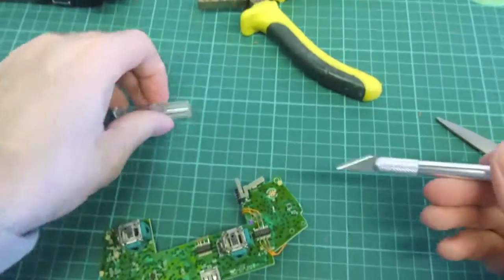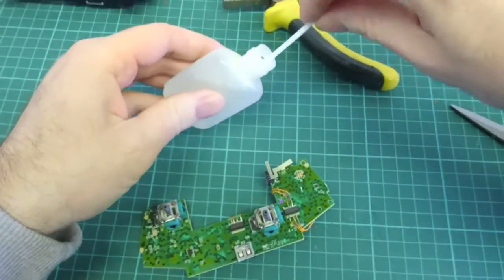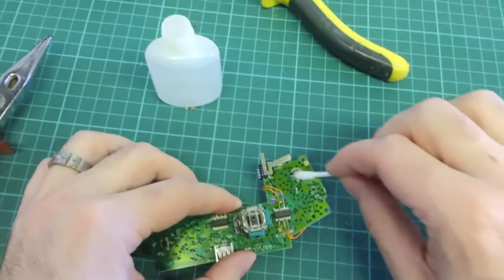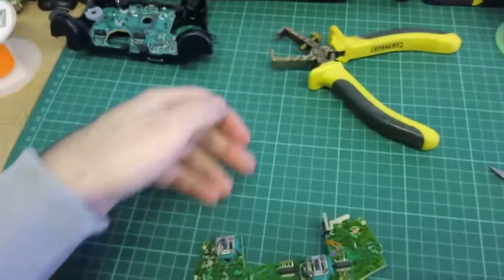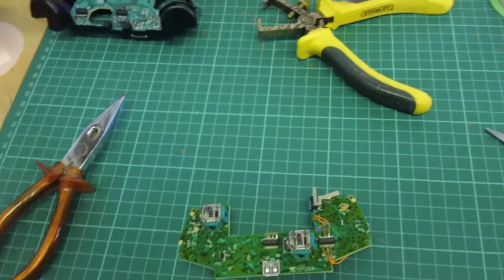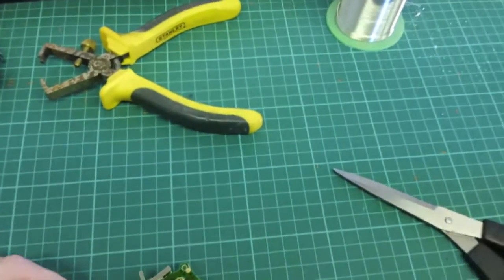There we go. You can connect straight to there. I also use liquid flux — it's just to clean the contact and ensure we get a nice long-life connection with no corrosion. You don't have to use it; you can buy a small bottle on eBay for around 99p. All it does is etch the copper to make sure you get a nice connection. Just tin that contact and solder your wire to it. Give it a tug — good connection there. Keep that connection nice and small, tidy and flat, because your button's rubber strikes down on top.